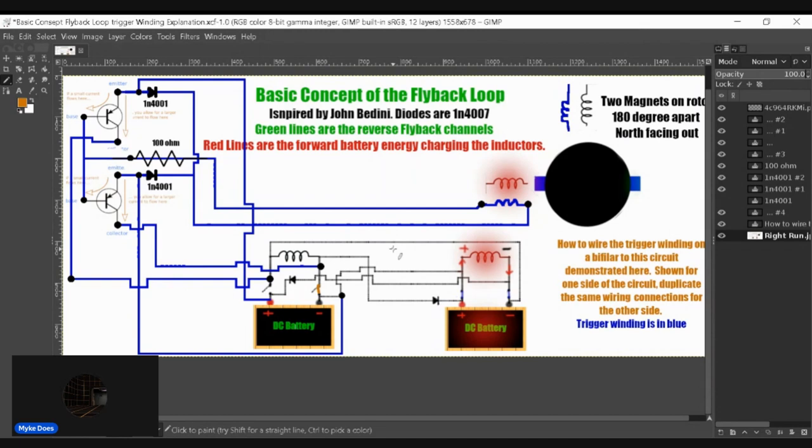Here's a possible issue with having a trigger circuit attached to this flyback loop circuit. The possible issue is when this side flies back, you're going to have a positive right here coming off this through this high voltage diode, positive hitting the battery, and your negative flyback will hit here, right? Assuming the battery does not absorb all the flyback, the positive signal will go up here